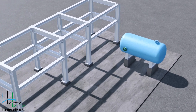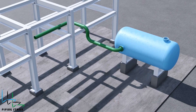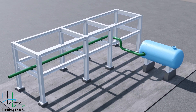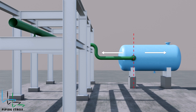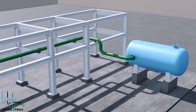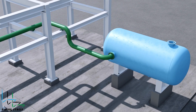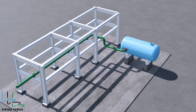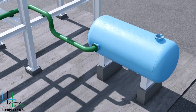The position of the nozzles on horizontal pressure vessels is of great importance. If a nozzle is in the same place as a fixed saddle, this must be taken into account in the pipe design and pipe supports. For example, as you see in the animation, the nozzle and the fixed saddle are in the same position. If you place a guide on the subsequent support, the nozzle will interact with the guide support due to expansion, resulting in high stresses on the pipe or nozzle. This is why we have to avoid placing a guide on the subsequent support.